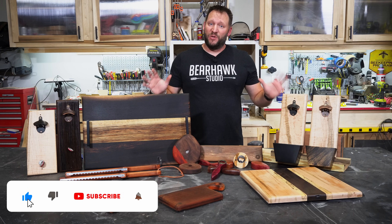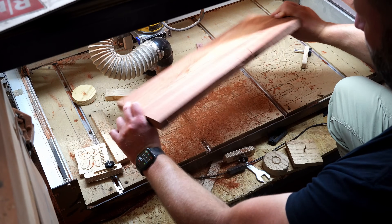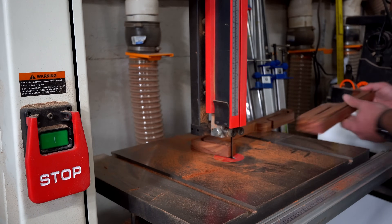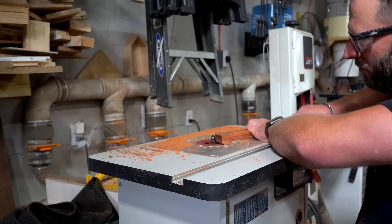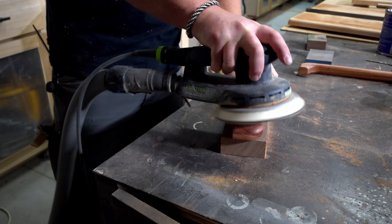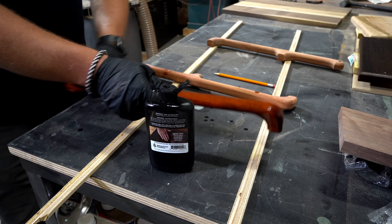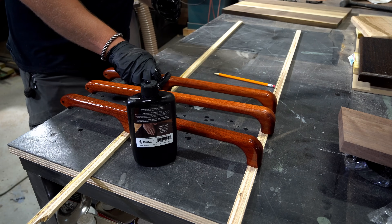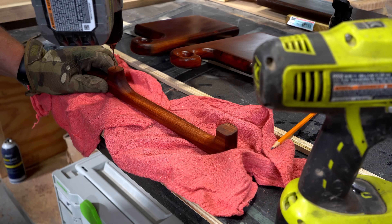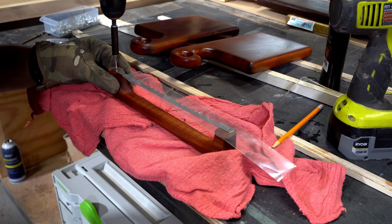And if any of these projects have given you good ideas, the concept is pretty straightforward and I could see some of you master craftsmen getting extremely detailed with yours. I drew up a simple outline and cut it out with the CNC, then ran all sides across a half inch round over bit, except the faces where the blades will mount. Then I used the orbital sander to knock down any hard edges and ran over all surfaces with a 220 sanding sponge. These will be directly touching food, so definitely use a food safe mineral oil. The blades do come in a few different lengths, so whether you want to use my design or your own, triple check that you've got that measurement correct before you ruin a whole batch like I did.